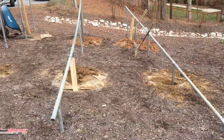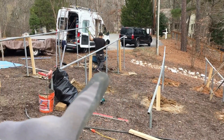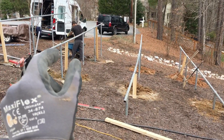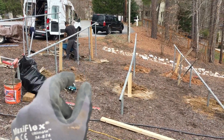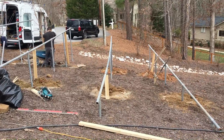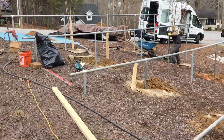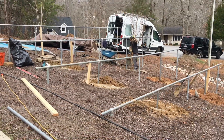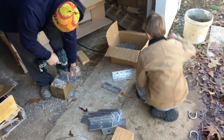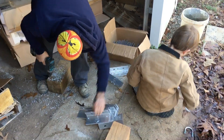I'm actually going to have two IronRidge ground mounts — a four-panel and a three-panel — and I'm going to splice them together, probably right in the middle. We don't always get the best solar sites. This is a challenging site because the solar window doesn't get a lot of sun and there wasn't a lot of room to fit a ground mount in. The customer asked me to spec something out three years ago, and this is what we came up with. It's on smaller pipes, so we are drilling out the IronRidge brackets so the U-bolts will fit.